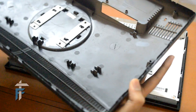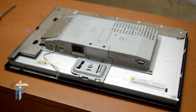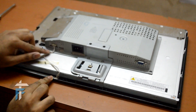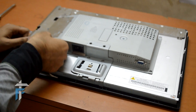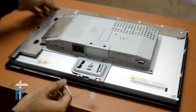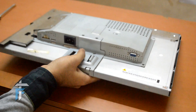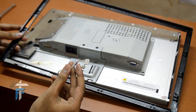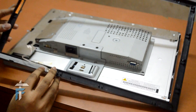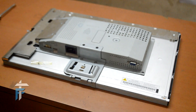I have turned the monitor over to the back side so we can remove the back panel easily. It has got no attachments or screws. We will just remove it — it is pretty dusty — and keep that aside. Now you can see that white wire coming from the front panel; we need to remove that pin. You just need to press the pin and pull it, and it will come out. I'll lift the main monitor and slide the front panel below it. Now the rectangular front panel with the wire connection is removed. You can see those connections — they are all touch capacitive buttons. I'll flip it over so we can see it, and we'll keep it aside.